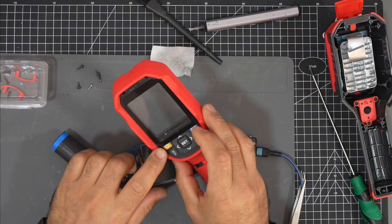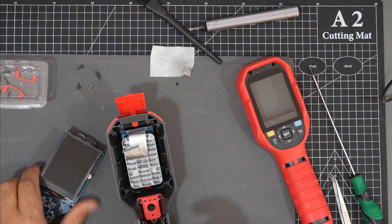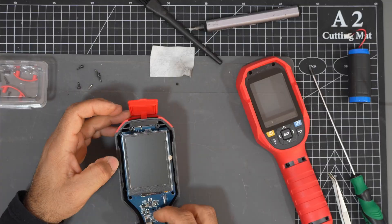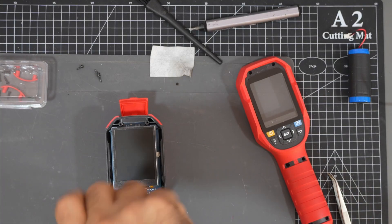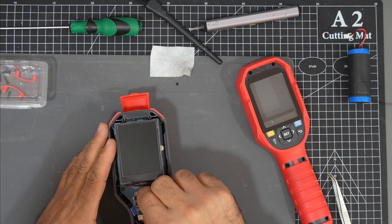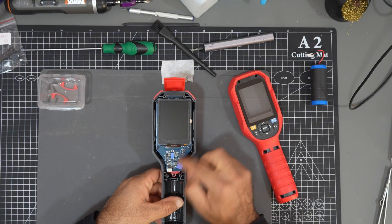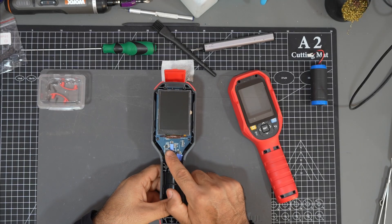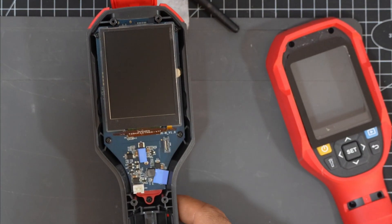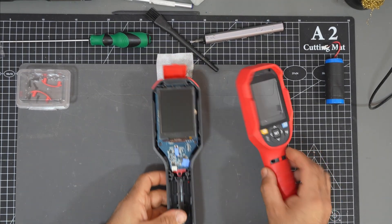The camera is now fixed. Let's try to turn it on without the charger, but we need the front panel since the switch is there. Give me a few minutes to install it all together. I installed the board into the case and added thermal pads over the ICs — the one I just replaced and another one — to protect them if they get overheated again. Let me put the front cover on and we'll test it.